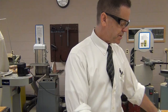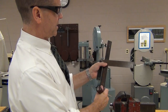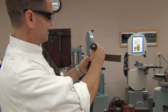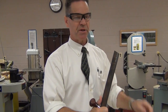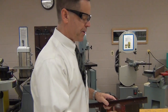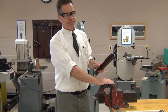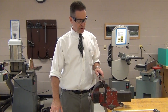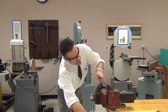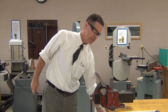First of all, I'm going to take my tri-square and hold this here, and I can scratch a line on here as a place to cut. Maybe you can see a little line scratched in the surface of that. Then we'll put it in this vise. It works a lot better to put these pieces of steel into metalworking vises compared to woodworking vises — they don't grip as much in a small area and don't exert as much force. I'll get this guy on here really tight; that's going to hold it really well for this kind of operation.